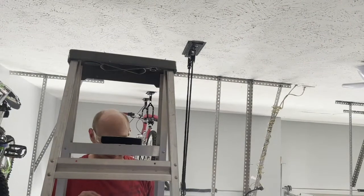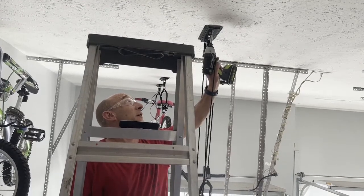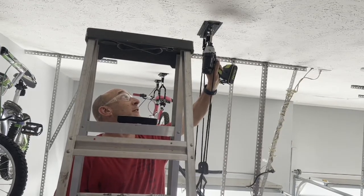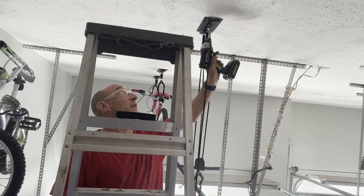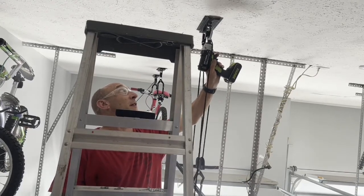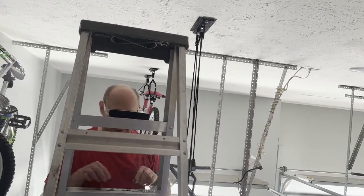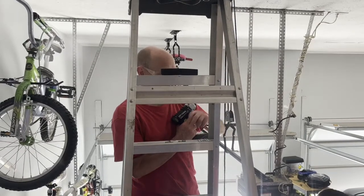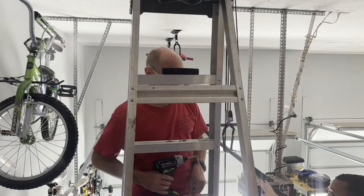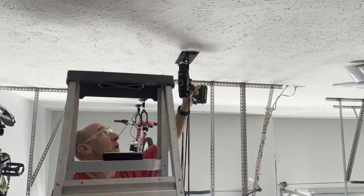If the stud is a little bit crooked, you're going to need to go through the stud, so you might need to go in a little crooked too. That's a lot better right there — that one's definitely in there right. We'll keep it on the track. Just in case, we'll put some extra stabilizer screws in. Making small pilot holes before you put your screw in can help make this a lot cleaner. We've got a couple that are good and a couple that are just going into drywall.